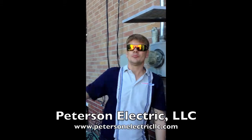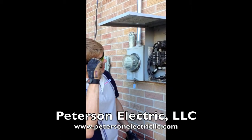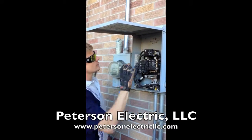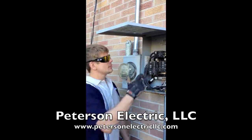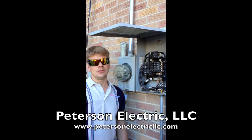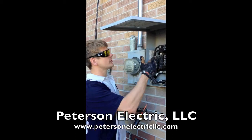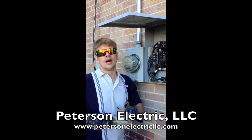Your panel might be sitting right in the dead sun and getting beaten on all year — this keeps the aluminum feeders cool. With polarized glasses you can actually see a little bit more, so I can see a little more heat stress here. The lugs have changed a little bit — sometimes you can see one versus the other. But if you start seeing melted plastic or melted insulation, you're past that point because by then the threads are bad and you can't redo it. This is preventative maintenance.